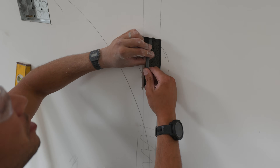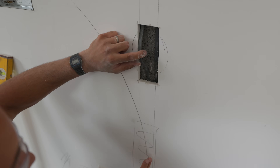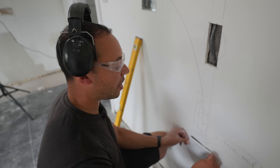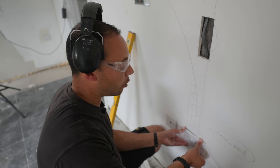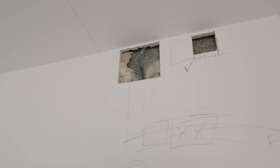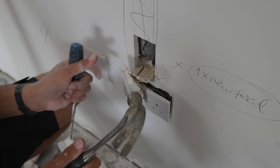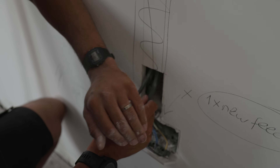I've just opened up this bit of wall here — I can see the dab is right here, so it just misses it. What they normally do is gunk it all up around the actual socket, so that when the socket face plate gets screwed back it's nice and solid. When the socket screws back it clamps onto the wall, so it's very important that the wall is structurally sound and solid around it. When I look up — I've got movement. There we go.